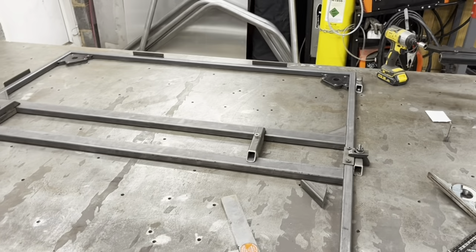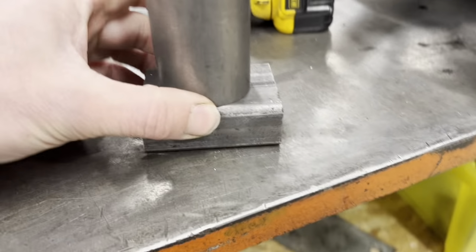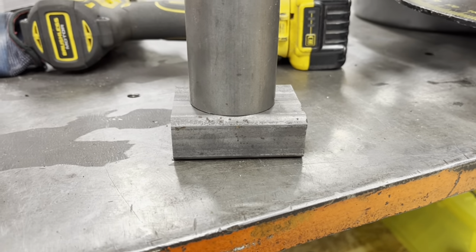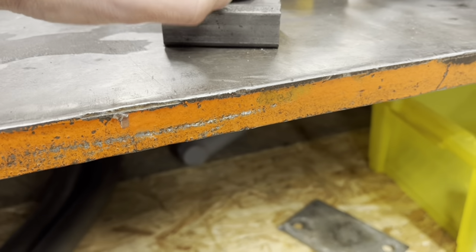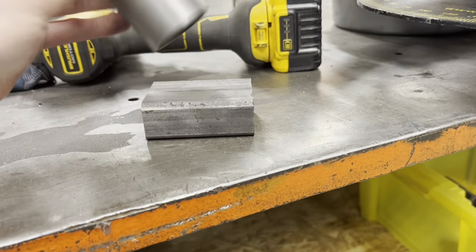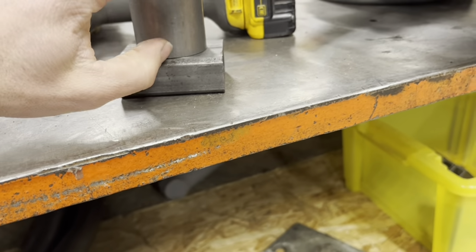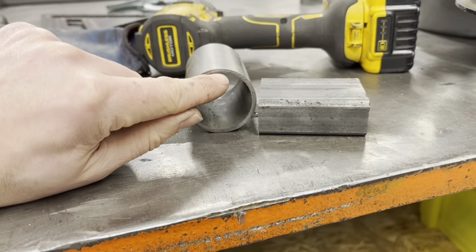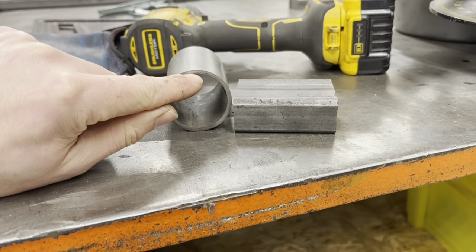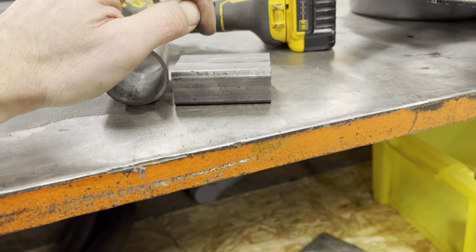If you watch any cage video, if you just butt a tube, if you got a piece of roll cage like this, yeah, and I just shoved it on top of there and welded it, wrong, completely wrong, you are probably welding the outside mil and a half of this tube to that. That is all you will be welding. It will just sit on the top. When you 45 it, you are welding basically as you arc and the weld goes inside that 45, it's remelting all of this material and shoving it onto there.